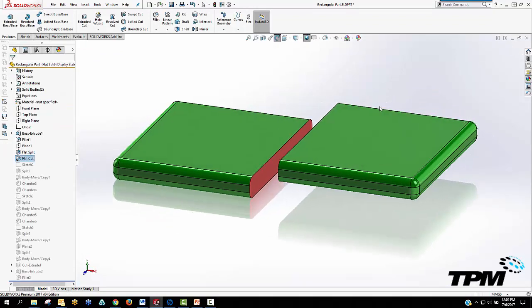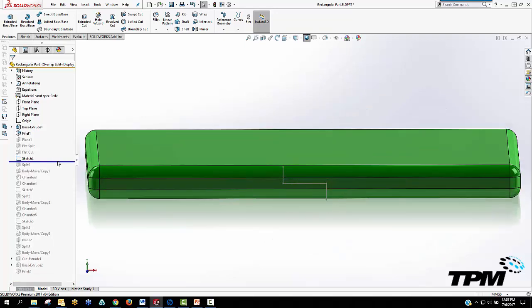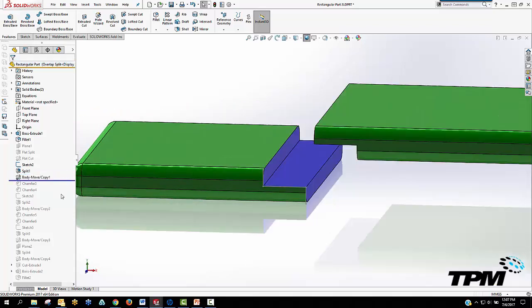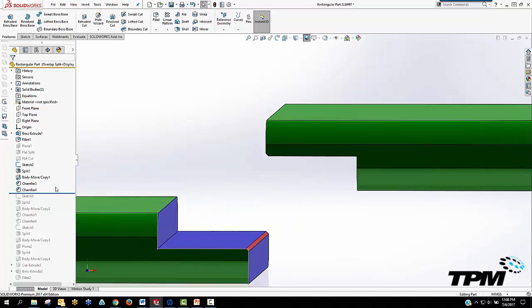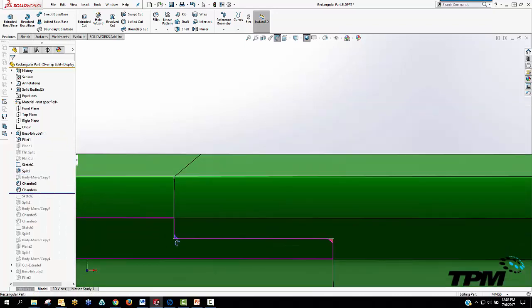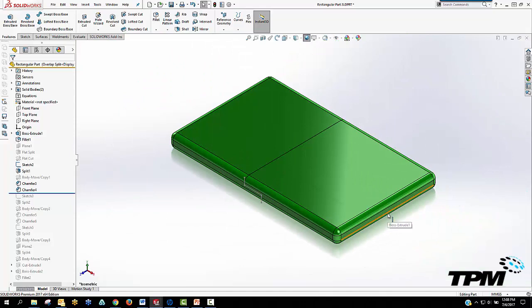Then you have an overlap. You see how I drew a line and used it to split apart. Then add the two chamfers to allow for the excess glue or epoxy to drain out, and this will create a good bit stronger bond when it's glued back together.